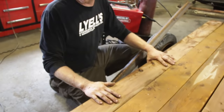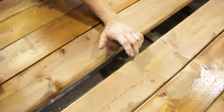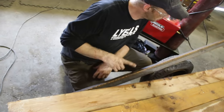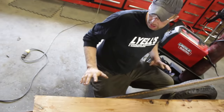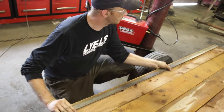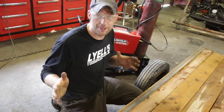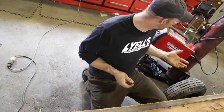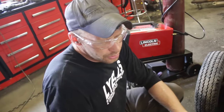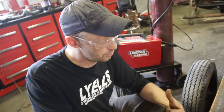We've got our 2x6 cut. We've got to cut the sides — there's 2 and 3/4 inches we need in between. We'll probably use the full width of the 2x4 and cut 3/4 inch off one of the 2x6s on the table saw. If you have a skill saw, don't worry about it because if your line is a little crooked, that's what this 2-inch angle iron is for — it covers up all mistakes. Wood, once you cut the wood it's gone. Metal, you can just keep adding metal with the MIGPAK 140MP, which we're going to use to weld the rest of the trailer. The money you save building your own trailer more than covers the cost of the welder, and it leaves it open for all the other projects you want to do in the future.